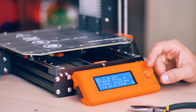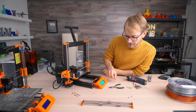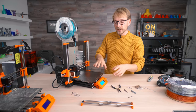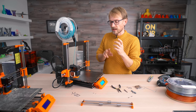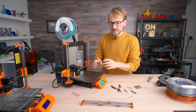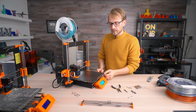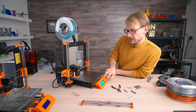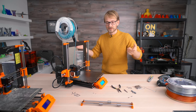Because we've now messed with the bed height — this looks like it's a good bit higher up — we do need to run the entire first-run calibration wizard again. Let's do a full reset. XY calibration okay, XY axes are perpendicular — congratulations! One more thing noted in the instructions: while you can use Calibrate XYZ in the firmware menu, you cannot use Calibrate just Z, because the bed now sits 3mm higher. That also means you're losing 3mm of Z vertical build space, though you're gaining that 1cm in Y if you configure it that way.